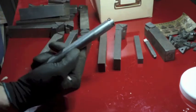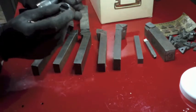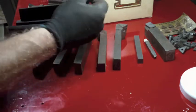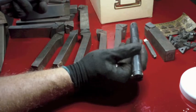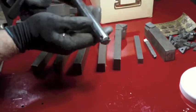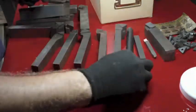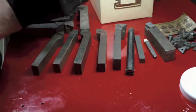One more holder to show you - this one here is a boring bar. It's got a little itty-bitty cutter in there for reaching in and boring an internal on a cylinder. This is a Warner and Swasey Company, Cleveland Ohio, M4362 boring bar. Couldn't pass up on that. On this end you've got a diagonal hole to put another cutter in, so you could switch it around - double duty.